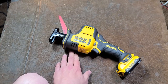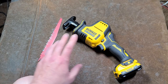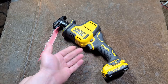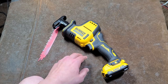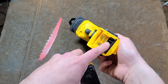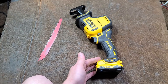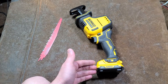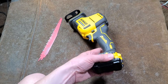The kit is about $170, which includes one 3-amp battery. I have a 2-amp battery since I bought the drill and impact driver individually. I bought this as tool-only for $99. Apparently this is the same thing as the 20-volt Atomic — the Atomic uses a different controller to limit power to the motor when running with the 20-volt battery. The reason 12-volt ones only have three prongs instead of four is that the extra prong is for thermal sensing. On 20-volt tools, it's mid-cell voltage sensing to prevent battery imbalance across individual cells. With only three cells in these 2-amp batteries, they don't really have to worry about that.